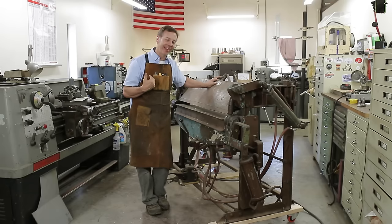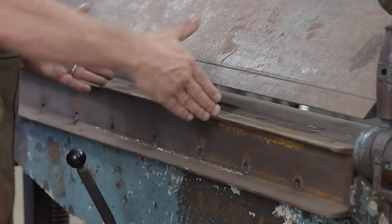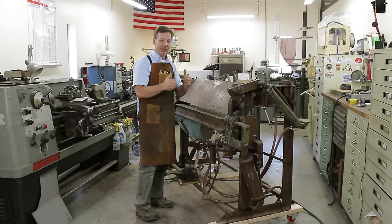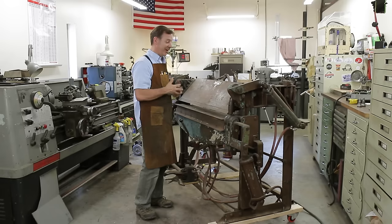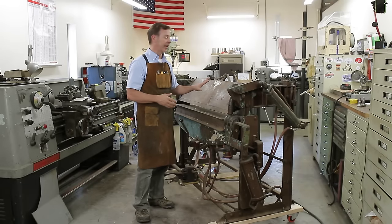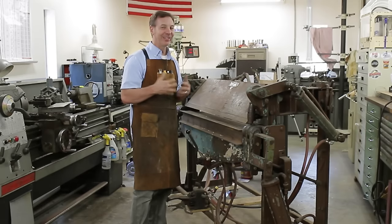And the advantage to that is, you know, when you're bending a box, what happens is you fold up the sides, and then you put it in here, and you need to fold up the end. Well, if the fingers are really short, well, you can only bend a box that's so deep. Well, this one here, theoretically, I could bend a box that has an 8-inch side on it. So it makes it a very, very versatile machine. Drawbacks to long fingers, though, is you lose capacity. Like I said, this is a 14-gauge machine. I start putting really long fingers on here. Well, it may reduce it down to more like an 18-gauge bend,